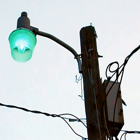The mercury vapor lamp is a negative resistance device. This means its resistance decreases as the current through the tube increases. So if the lamp is connected directly to a constant voltage source like the power lines, the current through it will increase until it destroys itself. Therefore, it requires a ballast to limit the current through it. Mercury vapor lamp ballasts are similar to the ballasts used with fluorescent lamps. In fact, the first British fluorescent lamps were designed to operate from 80-watt mercury vapor ballasts.